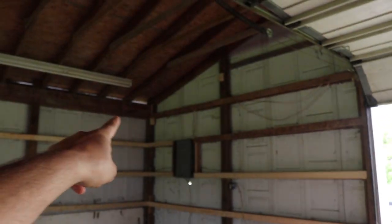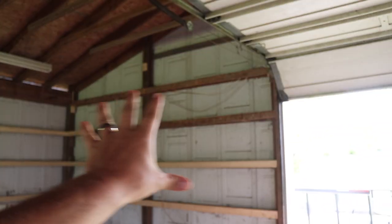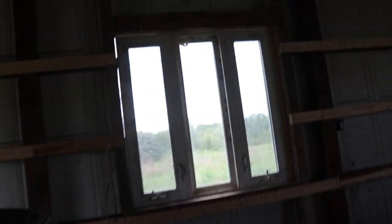I fixed that board, notched it for the beam so it sits where it's supposed to, and got everything tied in nice and snug. Around this window I boxed it in — I'm going to have to seal off the seams with foam sealer or weather stripping just to keep the breeze out. Maybe I'll do weather stripping on the inside and outside to keep the breeze and rain from coming in. The only problem with foam is if I ever want to replace the window it's going to make a big mess.